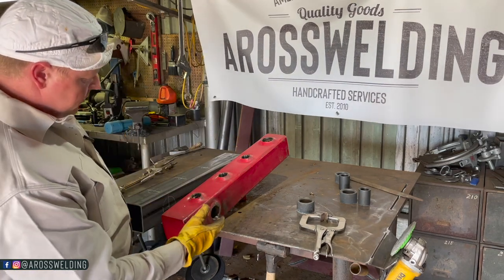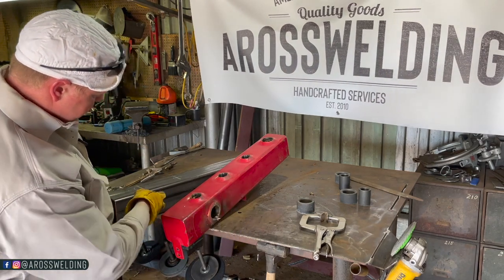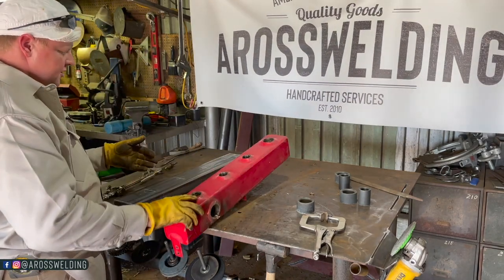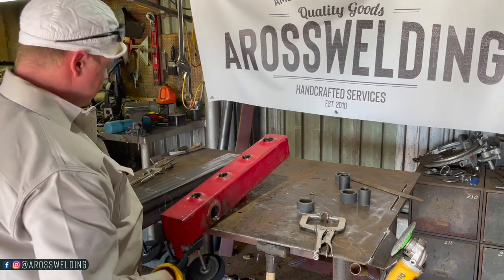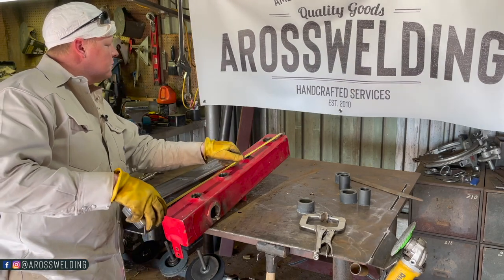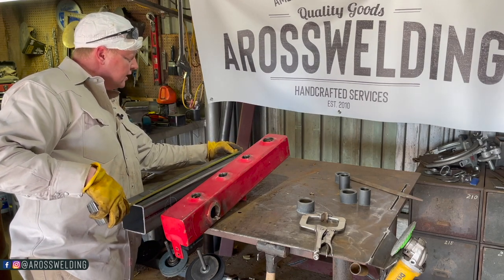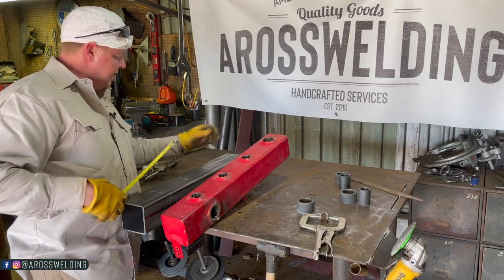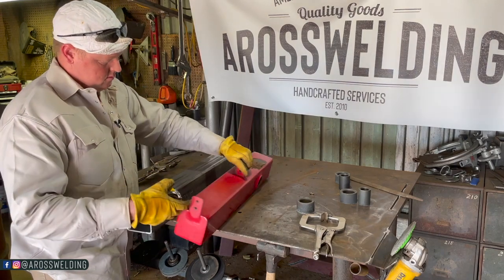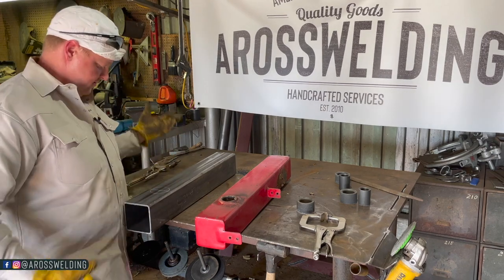But I want to check my roll. I want to make sure that everything I got laid out matches this one. So got a 2 inch here, 2 inch here, and then we got a 2 inch here, 2 inch over here. And we got our four holes up here, and our plates are gonna go down there. Pull a measurement one more time. 3, 9.5, 15.5, 21.5. 7, 7, 5.5, 5.5. Everything looks good.